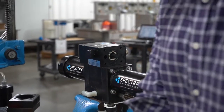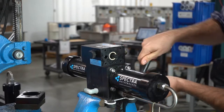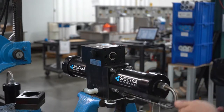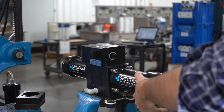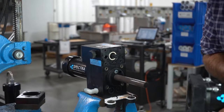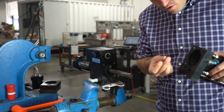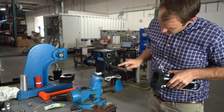With this removed, you'll be able to lift up off it. I'm just going to break the seals here with the wrench — these ones are actually pretty loose. You might splash water all over you. These O-rings a lot of times are stuck on here, same with this seal right here. This one's actually broken off inside here, but this typically goes right here. As far as this mating to this surface, you've got the cylinder O-ring and then the two check valve port O-rings there.